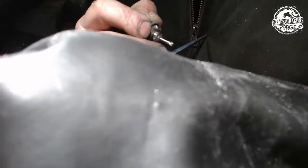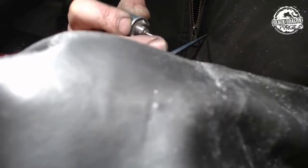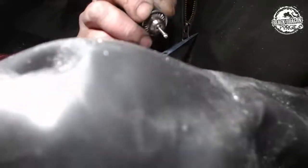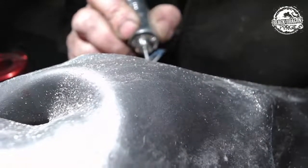So I'm cutting on this side, not on the other side. When I start cleaning up I'll use the front end of the burr, but where I'm aggressively removing material I'll use the back end. Now at a slight forward angle I'm going to be cutting with the front of the burr.